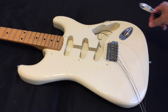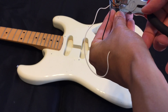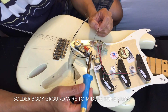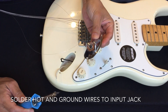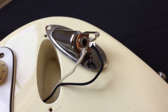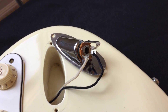I've already removed the screws to the quarter-inch input and removed the two old wires. Next, I prepped the ground wire with a little pre-solder, then soldered the ground wire to the back of the middle tone knob. That's what it looks like when I finished soldering the hot and ground leads to the quarter-inch input. I've decided not to show my soldering process because it's my first time and I don't have good technique, so I'm just showing you the end product.